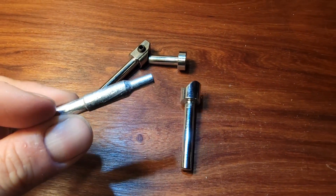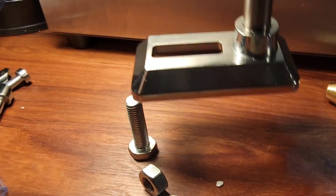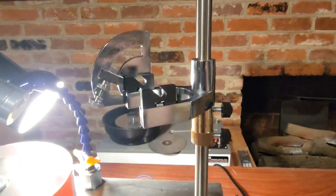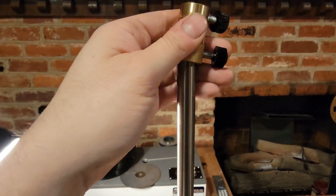The machine also comes with a couple of dops: one 6mm flat dop and one larger V-dop, plus the table adapter dop assembly. This is how the original mast is assembled, using the bolt, washer, and nut from the bag to fix it to the base — then the split nut, handpiece holder, and handpiece are put on. Note: we've run into one machine where the split nut had some burrs and would not go on the mast smoothly. If so, just lightly sand the inside of the nut until it fits.